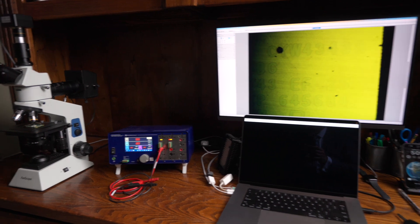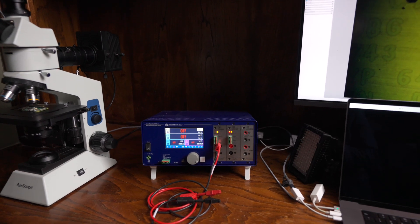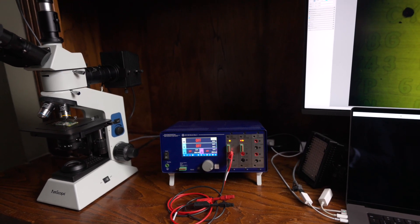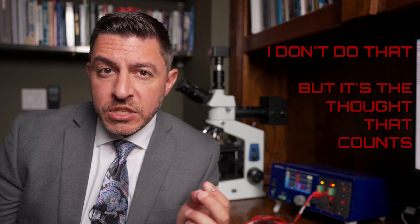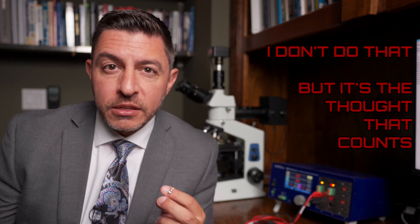Here's an overview of the setup: the microscope right there, a power supply to run the LED so I can precisely control the current — a potentiometer and battery would be fine, but I have this power supply so I'll use it — and up here will be the image from the microscope. The chip itself is silicon with a label etched on it: CYW43438, which is the microchip. This LED is rated for 100 milliamps; I'm going to set the power supply to 5 volts and cap it at about 95 milliamps. I'll show the difference as I vary the milliamp range and how that impacts how well it can see through the silicon.